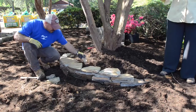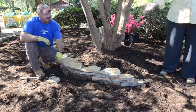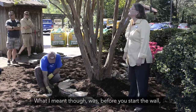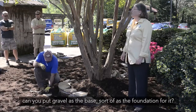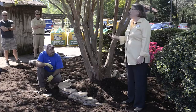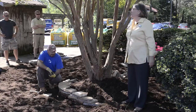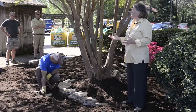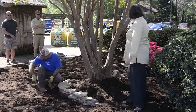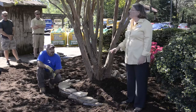Some of those top pieces are going to be a little unbalanced — a little larger than what's underneath them — so you can use rubble behind. It's good for drainage and support. It can be gravel or broken pieces of stone you have left over. On an edging wall like this you don't need to, but on larger walls it's really important to put gravel behind. This wall is the simplest — a beginner wall, where you get started in stone wall construction.